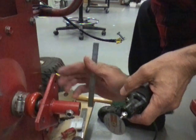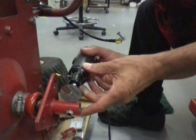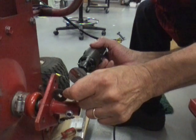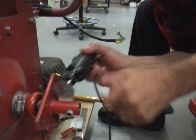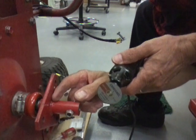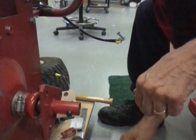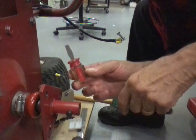If you score the axle a little bit it's not going to hurt. These cut-off wheels are going to wear down as you cut through, but keep the small worn ones - you can put them back on and that'll let you get closer to the flange than the big ones will. You want to cut as close as you can get, then rotate it around and cut the other side. Then I got some cheap stubby screwdrivers.